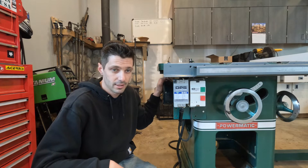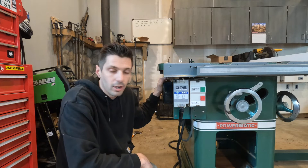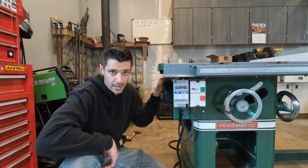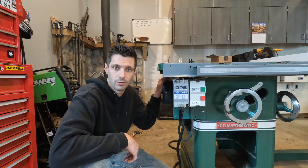It's a real simple process, you just need a few parts. The parts are a little pricey. This phase converter is about $180. This switch — this is a three-phase switch — it's about $60, which isn't too bad. So about $240, you can convert your three-phase tool to single phase.